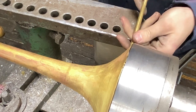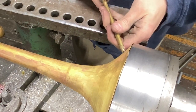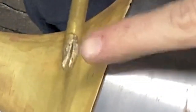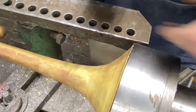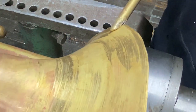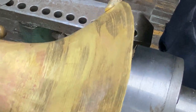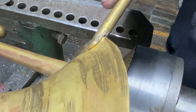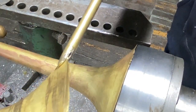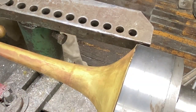If you dwell and then try to turn the 90 out, you actually twist your tool counterclockwise so you're holding even pressure. On my slip tool, one half is thinner than the other — the thinner half goes against the mandrel for more clearance. You get the tool on the bell and twist very subtly depending on the size of your slot. Twisting counterclockwise while pulling it out — but not too extreme.